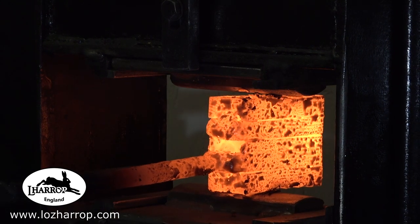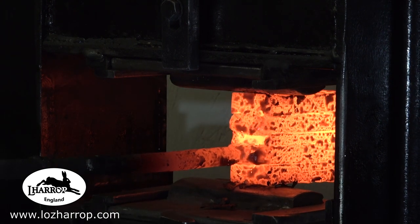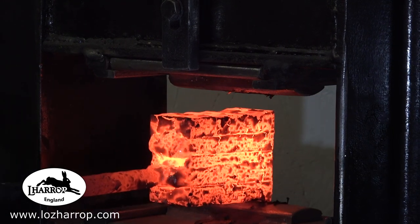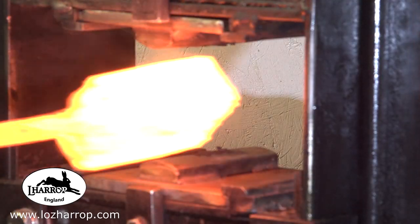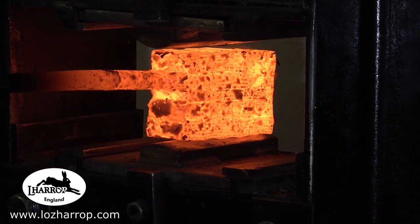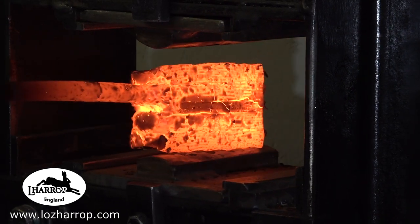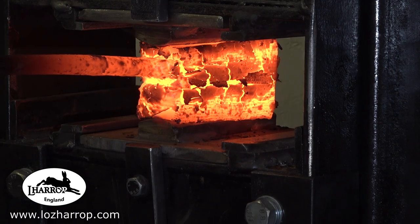You can see those two 1095 sections together in the middle there. These are the drawing out dies. What I want to do on this one is push the billet sideways slightly because it's kind of orientated wrong — the height wants to be across the width.